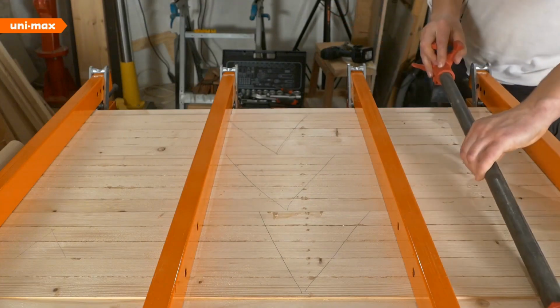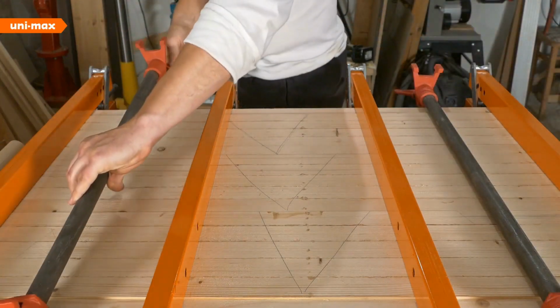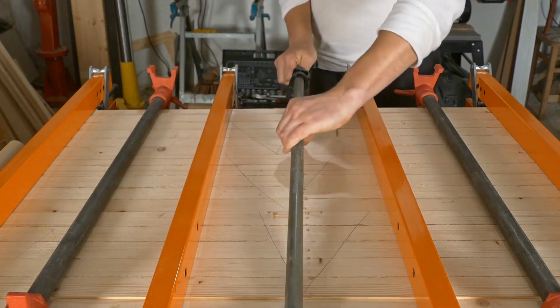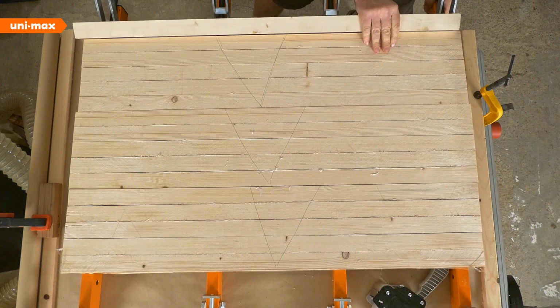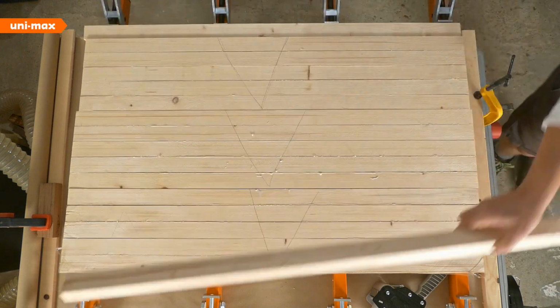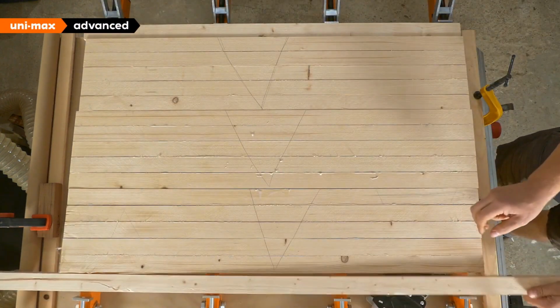Of course, we can supplement these clamps with some screw clamps to increase pressure and achieve a more even distribution. Similarly, we can distribute the pressure and protect the edges of the laminated wood by using spacers of the same thickness as the laminated wood. We will attach brackets to the rod based on the width of the laminate, with a maximum gluing width of 120 centimeters.